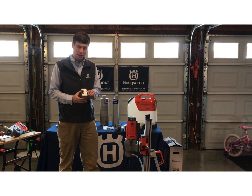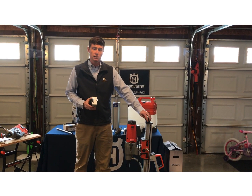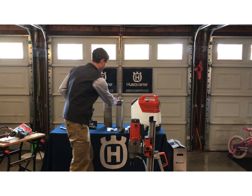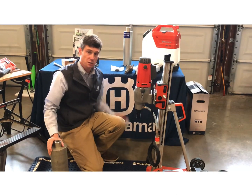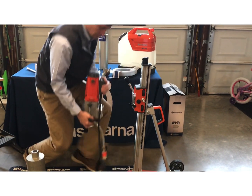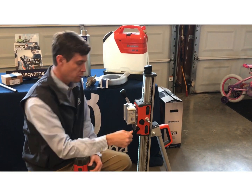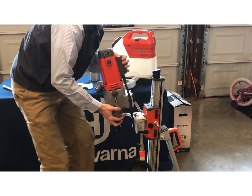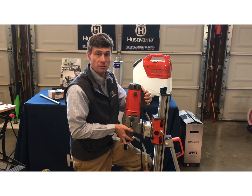The first item we're going to talk about is our two-inch spacer. This is our rig stand — core motors and stands are shipped together to drill up to a certain size capacity. When you need to go beyond that, you'll find the core bit doesn't have enough clearance and will hit the stand. That's where the spacer comes into play. Simply loosen and remove the motor, place the two-inch spacer into place, tighten, and slide your motor right back into place. This allows clearance for the bit to not hit the stand.